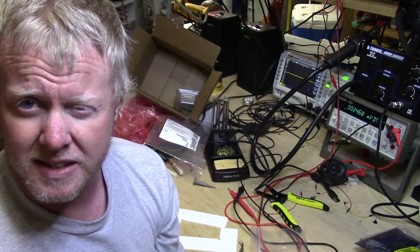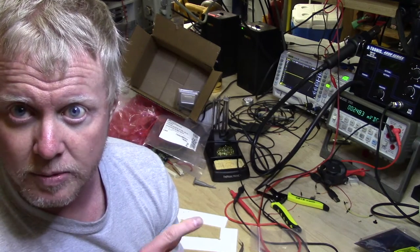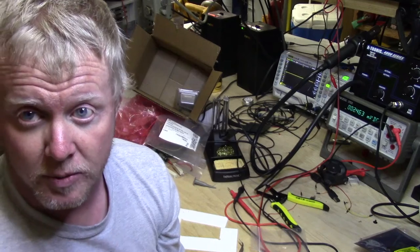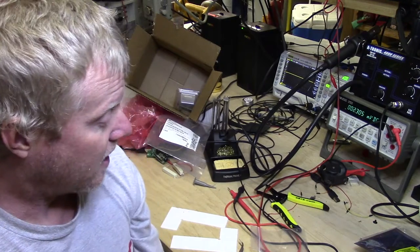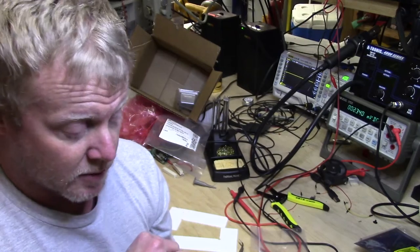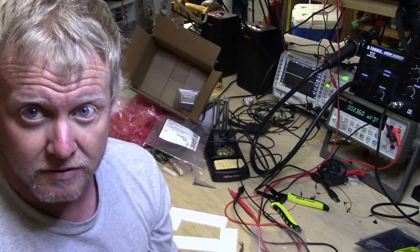Diodes sometimes are an issue. You may notice when I assemble this, I typically don't use the microscope on parts this big, but the markings on those diodes are really small, and I may have gotten one backwards or something like that. That's easy enough to swap out, replace or flip around. So when they get done in the oven, we're going to bring them over and test everything that we can. And obviously they're not going to do much until we program them.